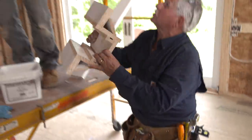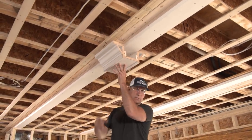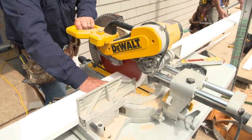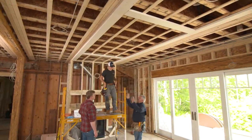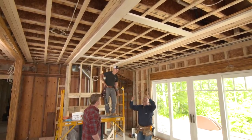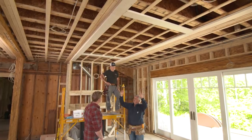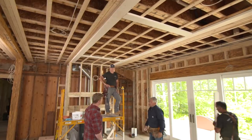So when I put it up there, Jeff, we'll slide it around and you can see how it looks — it's going to go right up there, just like that. 177 and 5 eighths. You can start to see the coffer design right here — they have a big rectangle. The beams will be built in place. The nice thing about this opening is it's 48 inches wide, so a sheet of plywood will fit right in there, and it's short enough so there'll be no seams anywhere. No seams, no plaster — it's going to be a nice painted look. Exactly.